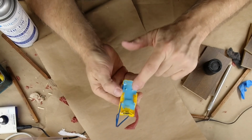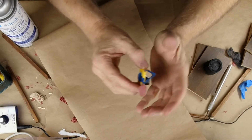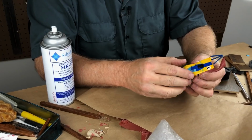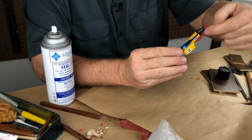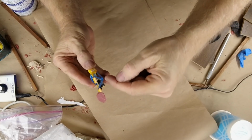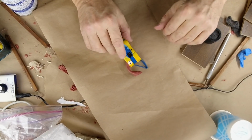I want the rubber to stick on this side because I want to make a solid block of rubber where only these few surfaces aren't bonding, so that I don't have to worry about cutting these little surfaces out. All I have to worry about is cutting down the sprue and funnel and around in here. I just have to follow the parting line and just follow along the vents. And that might just work out perfectly. So let's get on with it and see how we go.